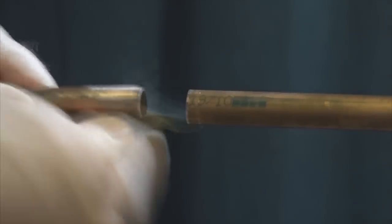Once you're sure you've got all the water out of the system, you're going to want to thoroughly clean all the points that you're going to apply solder to using some fine sandpaper, including the ends and the insides of brand new stuff too.